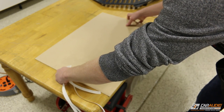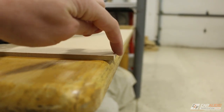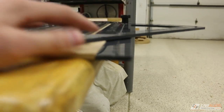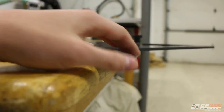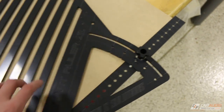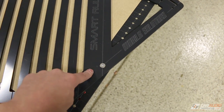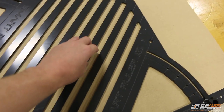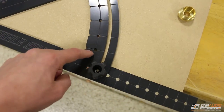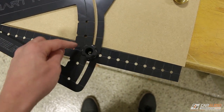To use this thing, I start by taking a piece of raw material and sticking it to my work table with template tape to hold it in position. Notice how I lined up the edge of the raw material so it's just barely sticking over the edge of the table — this was intentional so the straight piece lines up on the edge of the raw material and we have clearance underneath for this knob. The knob is reversible, but I want it on the bottom so when I'm coming across with my router base I don't hit it. We're going to use the Smart Ruler along with our bushing set and the router to cut some grooves. You can see multiple different lines here for different degree increments — in this case I'm going to use this hole here and line it up with my knob, which is 15 degrees.